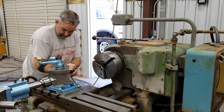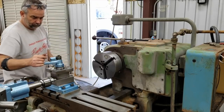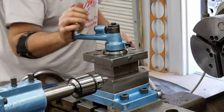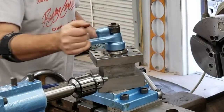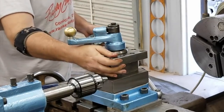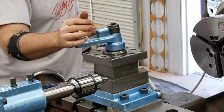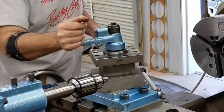One thing I didn't show: the ratcheting handle was missing the knob that goes on top. The threads in the actual handle were half-inch 20s. When I went on McMaster they had a couple of different options, and one of them was this brass knob. I ended up buying that and made a little stud and a spacer out of a half-inch bolt I just cut apart. I don't know what you guys think about the brass ball — I'm not sure about it — but leave a comment, let me know what you think, and we'll see you.